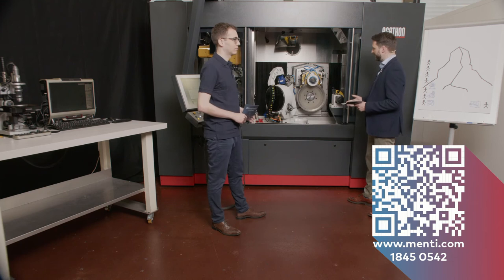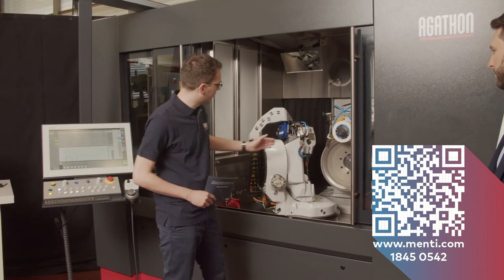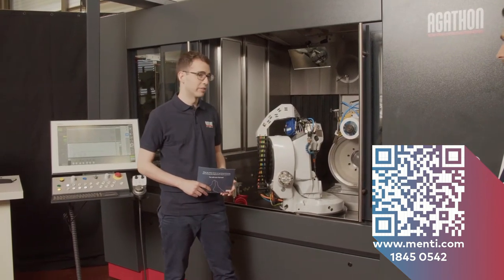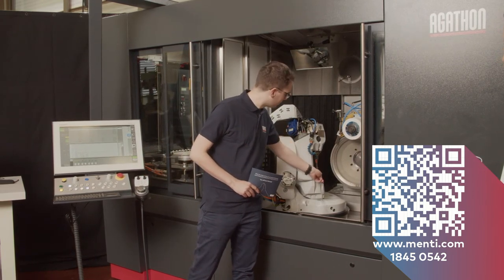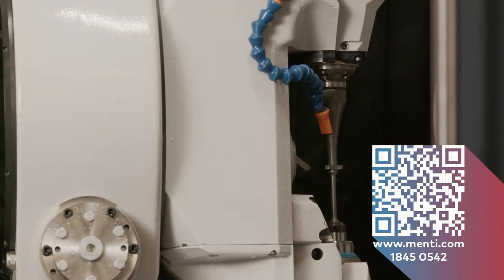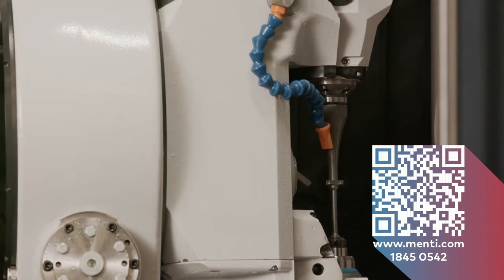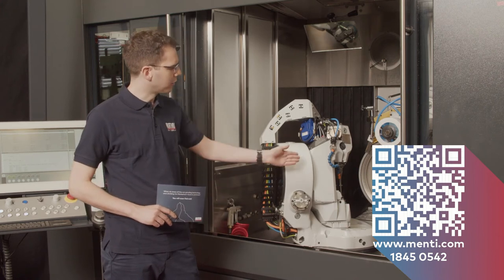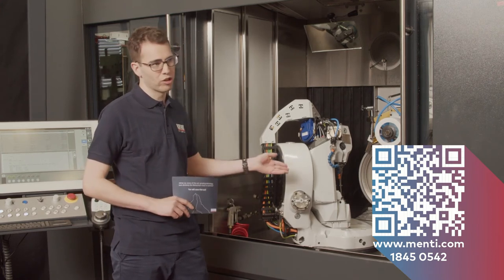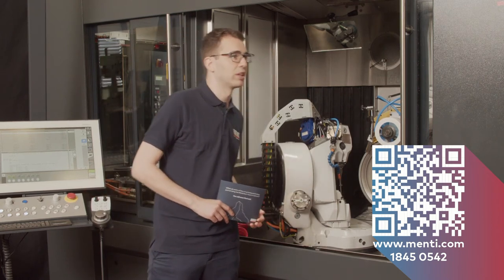Martin, can you tell us a little bit more on the position the machine is in right now? Sure. Basically, right now the machine is at its tangential position. That means that our clamping tools, so driving arbor and clamping arbor, are in a tangential direction compared to the outer diameter, so the periphery of the grinding wheel. In this position, we are able to grind, for example, chip breakers, as we said, or another example would be the profile that we grind here.